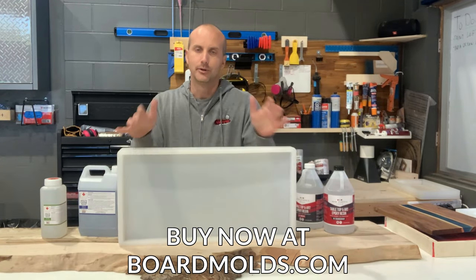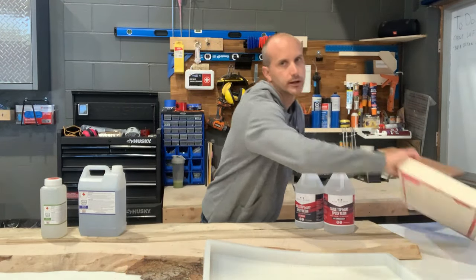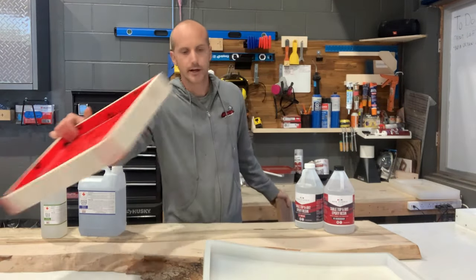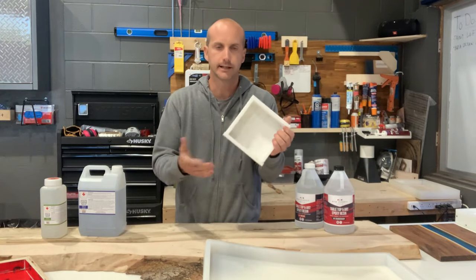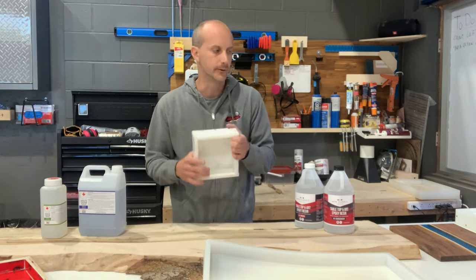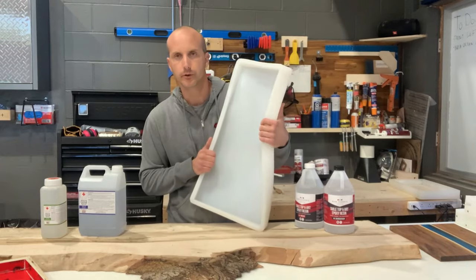They're better than the wooden tuck tape method, which I've demonstrated in another video. That's typically a wooden tuck tape mold that you have to build yourself. There's also things that make HDPE molds, which are also pretty good. They're just not flexible, and they still require work to unscrew, screw, reseal, etc. Which is why we prefer to use the silicone molds.